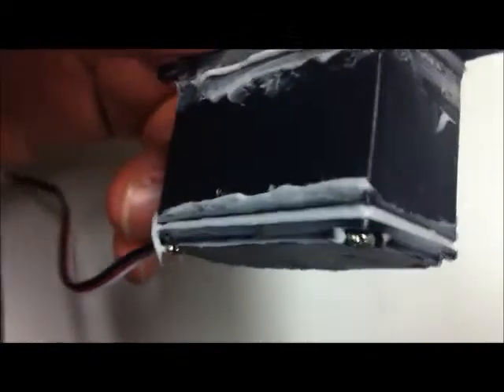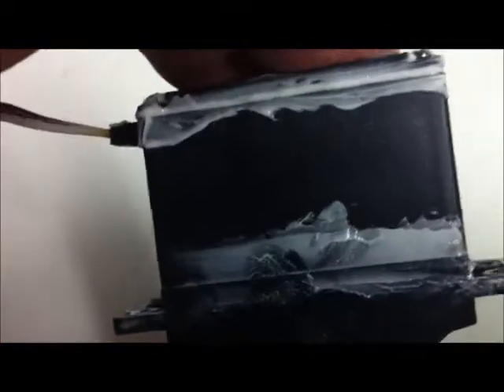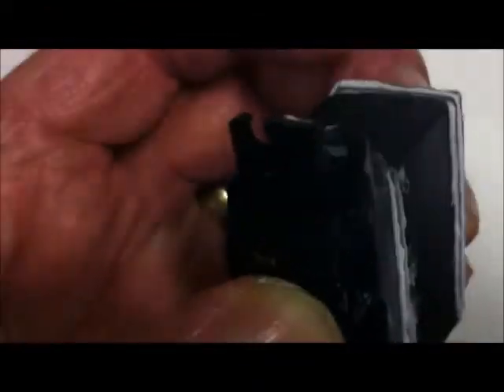We now have the line of silicone all around that one there. I've taken a little bit off the other one up on the gearbox join. Now when we squeeze them together - squeeze the sandwich and the cream comes out something like that - you can see it's a rather messy operation, but it's going to waterproof it very nicely. I'll just clean up the excess and leave a film over each of the joins - that's the plan.